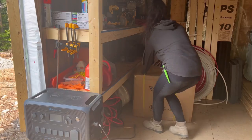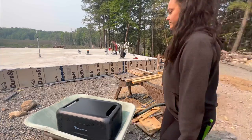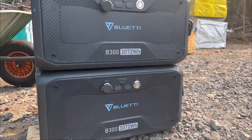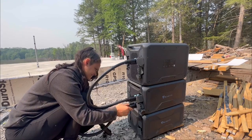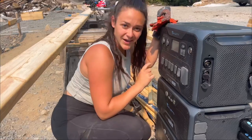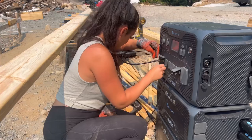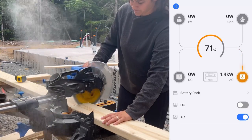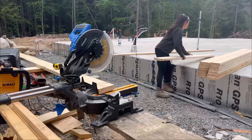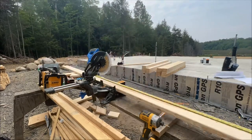Time to get out my new battery bank. My goal with having extra battery banks is to be able to use my power stations in emergencies like power outages, but it's also great for the build because it provides double the watt hours. Each battery provides 3,072 watt hours, which brings me up to 6,144 watt hours with two batteries, and you can go up to four batteries with the AC300 for 12,288 watt hours. The AC300 has six 20-amp outlets and one 30-amp outlet to power multiple devices at once. It's pulling about 1,800 watts with the miter saw, and the AC300 has a 3,000 watt surge which is perfect for most miter saws.